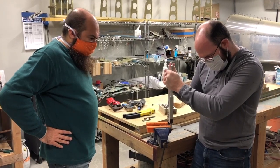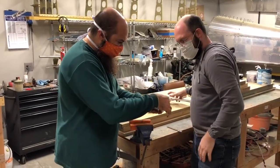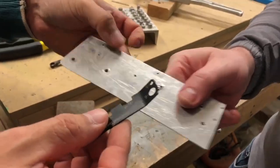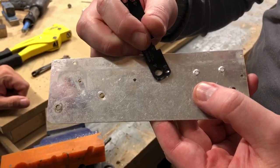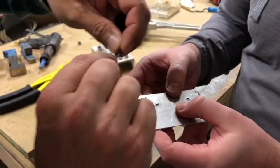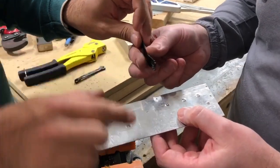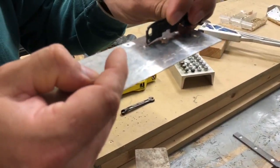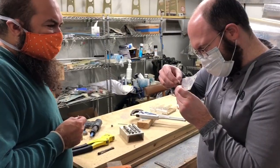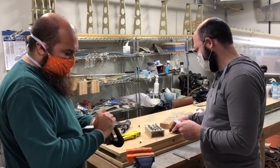Something kind of like that — oh yeah, that's doing something. There we go. Oh, that looks good — perfect. Let's see that one more time. So it won't fit over the rivet. And then the other one is this little notch — let me clean this off. I used this on rivets with ProSeal on them earlier. So you want to hold the notch this way. When it's resting on the top of the rivet, it shouldn't touch the dimple. It might be either just right or slightly over-set — it's just about on it.